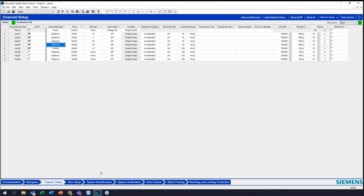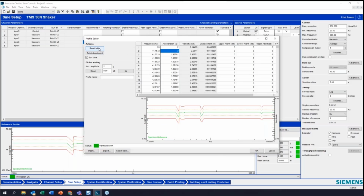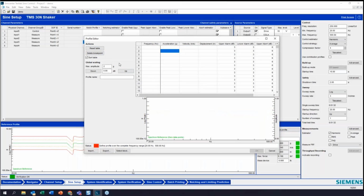So I have my channels all set up here. I'm controlling on input 5, which is this accelerometer in the middle here. And my main response is going to be in the Z direction on channel 3 here. That's this accelerometer on the end here. So let's start off with just a basic pre-sine sweep. So here I'm going to just delete all this and start over again.